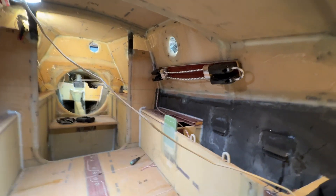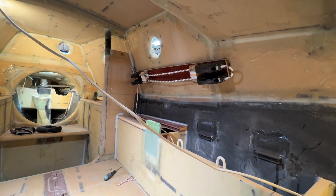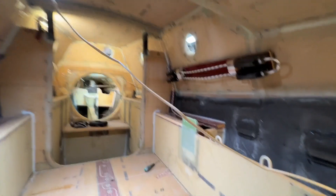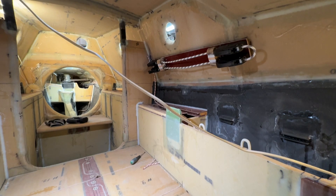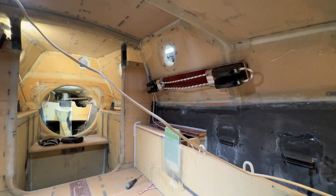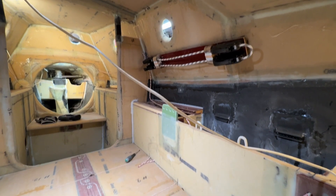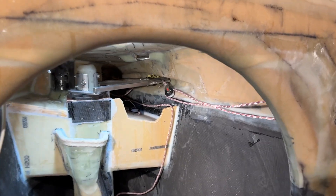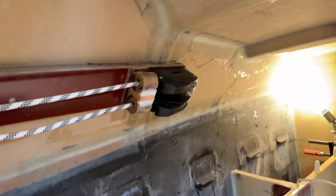Hello friends, now the vector winch is in position. I'm not sure it's pointed in the right direction to the tiller in the back — it's not precise, but it's not evident how to make that. So now I screw it down and do some wrapping around the fairleads. Back here you can see the tiller and the lines come in here. I'll drill new holes here, and here is the vector winch — the lines are going to go all the way down to the forward bulkhead to get some stretch in there.